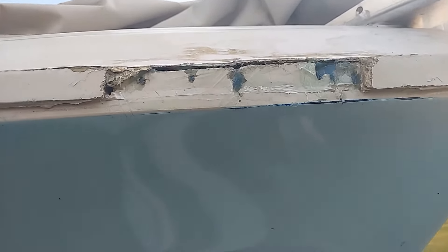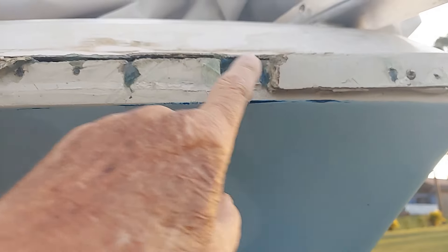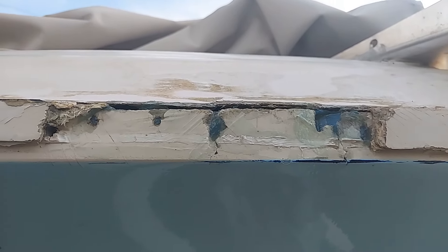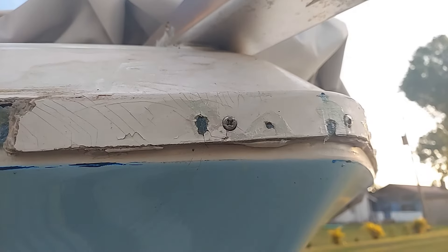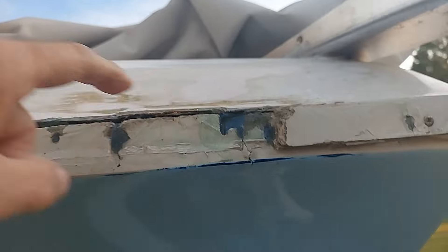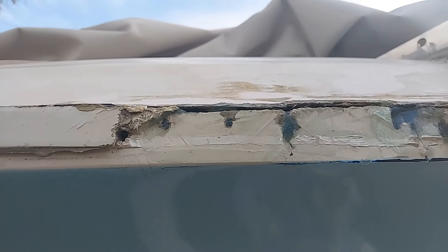Here's the first thing I did on this. I broke some pieces off and opened it up, and underneath each one of these little holes is a little sticky. I used some Total Boat structural filler and actually had extra, so I went along and filled in the holes that were used by the rub rail. That's the first step — next step is tomorrow to grind this back on both sides and on top, then work on putting new fiberglass in.